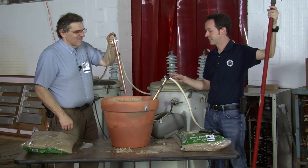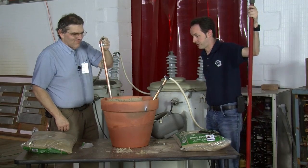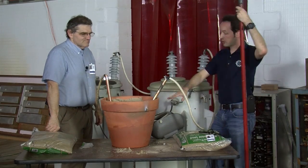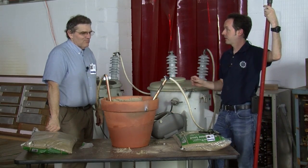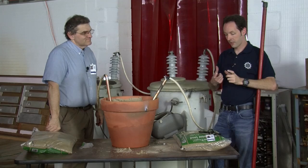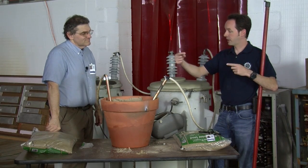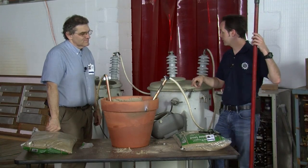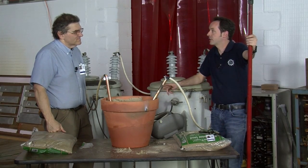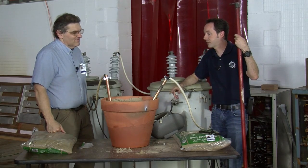The water's boiling out of the sand — that pipe was cherry hot. I think it's better to have one electrode you can control and move around. You don't need the giant volume, you need a shallow pan. As a follow-up video, you ever built a Jacob's Ladder on a 2x4? You know about the carbon tracking you get through the wood? I think this is doing the exact same thing. That's exactly what it is — and it's fusing as it goes. When the sand gets hot enough it melts and goes incandescent, at which point it becomes conductive and it just keeps getting easier and easier. It connects eventually.